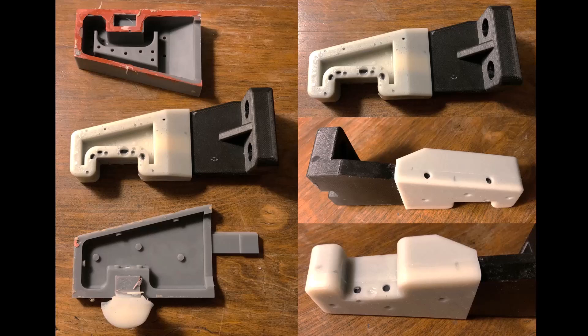As I mentioned, if you have a vacuum chamber, you definitely need to degas the resin before pouring; otherwise you end up with bubbles. You can tap on the mold as much as you want, but you're not going to get all the bubbles out. I had some bubbles on the top surface despite all the vent holes, but there were very few to none everywhere else — it was just on that top surface.